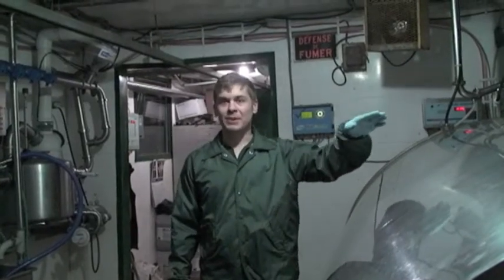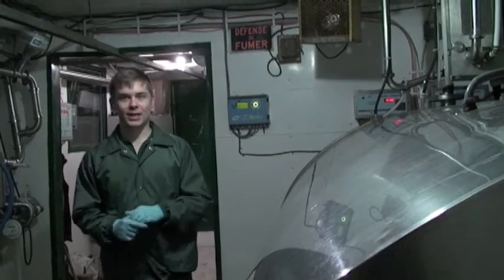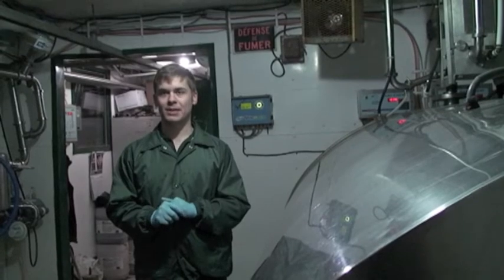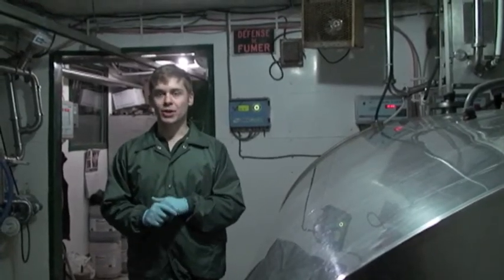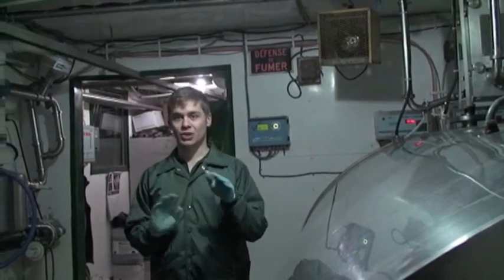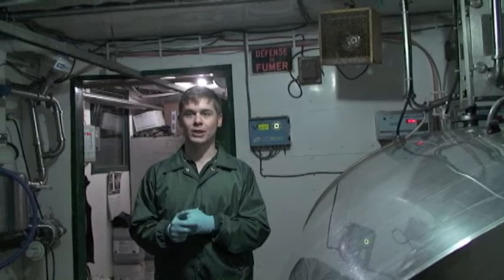There's a beater in the milk so that the milk can be stirred constantly every 20 minutes when we're not in milking time, and it's so that the milk can be constantly cooled down to the right temperature. It's kept at about 1.5 degrees Celsius, and we also have the beater so that the separation of the milk and the butterfat — which is the cream — tries to stay mixed together so that the milk can stay better for longer and also so that it doesn't spoil.